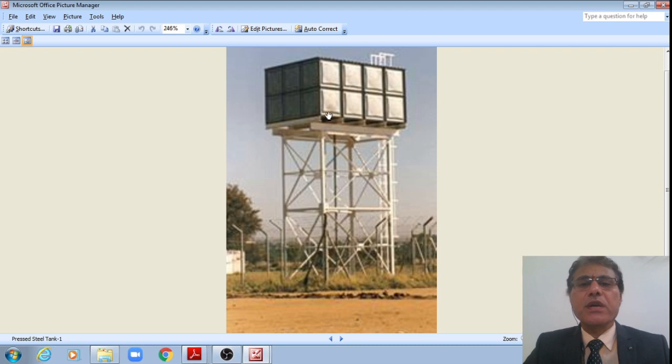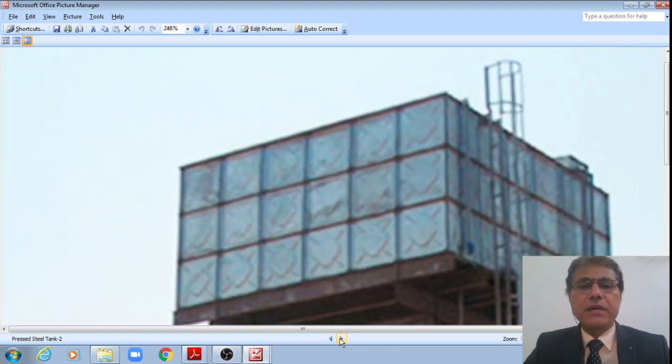And in turn, it is also supported on 1, 2, 3, 4, 5 number of longitudinal girders, which in turn are supported on 2 number of cross girders or main girders, and those 2 main girders are supported on 4 number of columns on a staging consisting of two panels, right, along with the horizontal bracing as well as diagonal bracing. Now this is for just medium storage capacity, student, right? Now let us examine another photograph